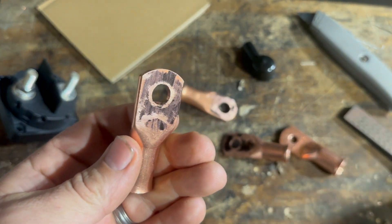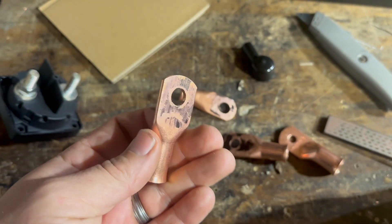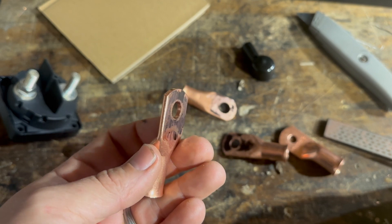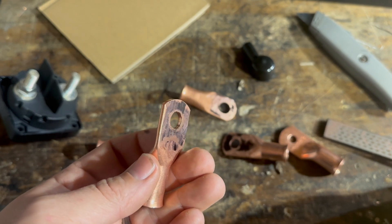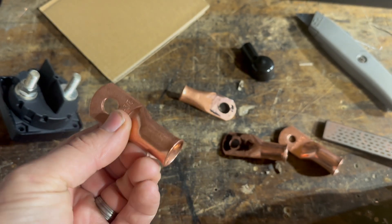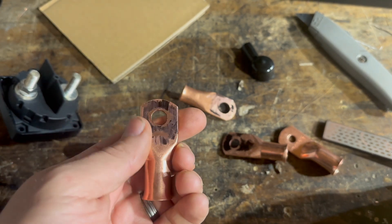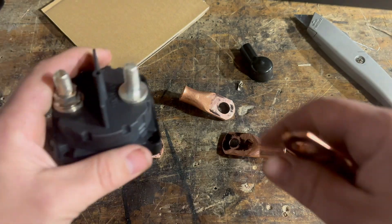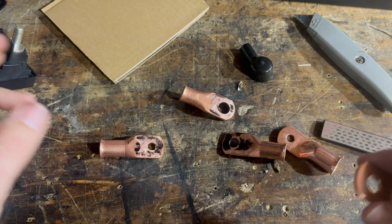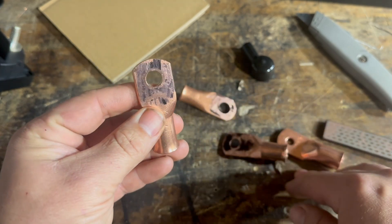When we're talking about 100, 150, 200, or 250 amps flowing through these for a half hour to an hour or more — or if you've got two inverters, you could easily be pulling or pushing 200 amps through these 4/0 lugs — you could be getting heat through here. Any kind of connection like this could be why we're getting heat.